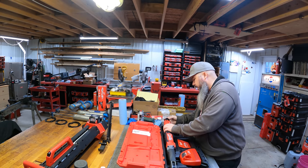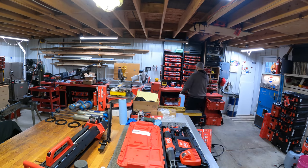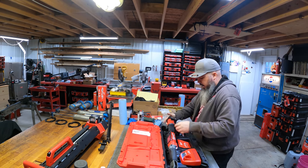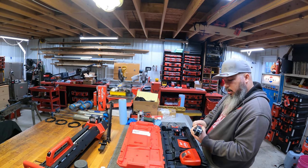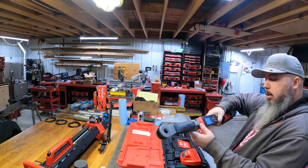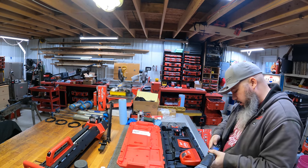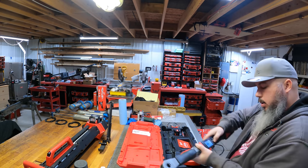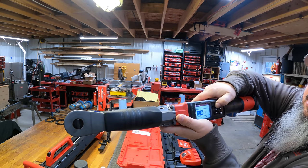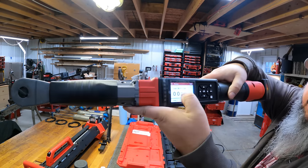Let's see if it works with a 6Ah battery — one of the XC6s. Yes, it fits. It comes up on screen. You can navigate around in quick mode, click OK, and raise the setting up. So here — 90 foot-pounds, say OK. Now you can see it's set to 90 foot-pounds.